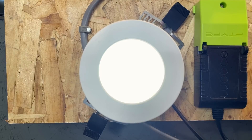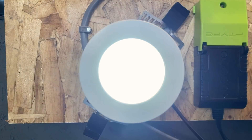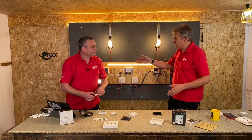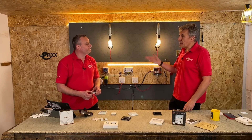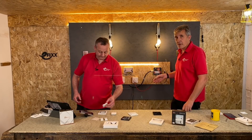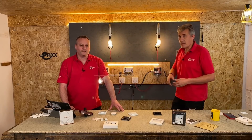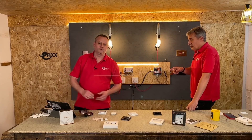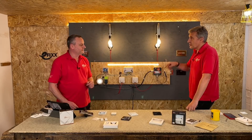So we've got it back up, and then we can dim all the way down again by just simply holding the button. Because that's an inline dimmer with a neutral supply, you do get a better quality dimming than you might with a conventional rotary dimmer, where you're always in that trade-off situation between the fixture and the dimmer.